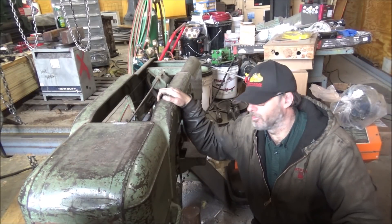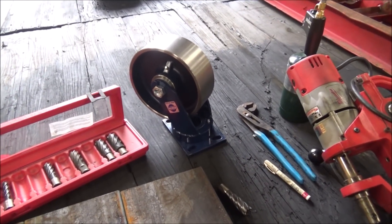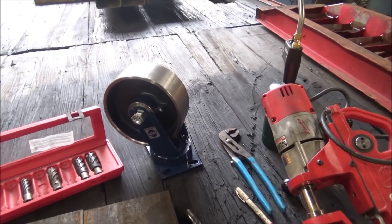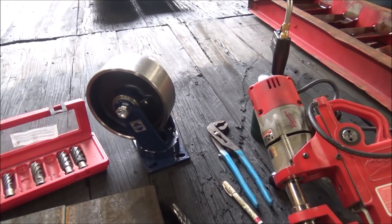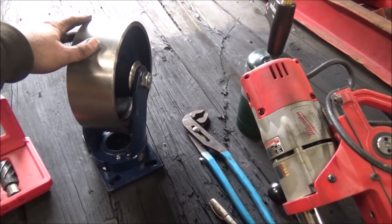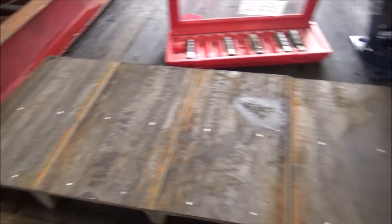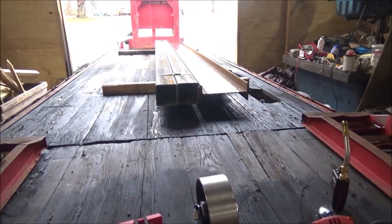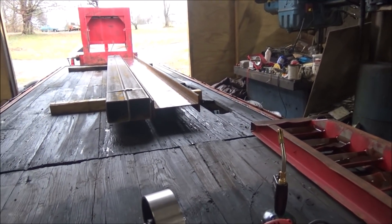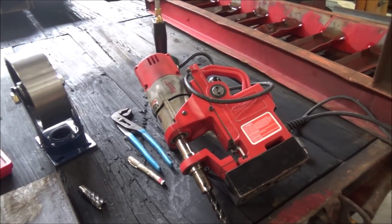Now they've got it all cut — it's drilling and welding time. Those gorgeous made-in-USA casters: big expense on this one, but we're going with a better caster than what was on the others because this is a lot heavier and bigger unit. RWM three-inch wide, eight-inch casters — should roll nice. My holes are marked out. I'm going to use the mag drill to punch these, and also drill that crane beam. I'm not going to wrestle it into the Carlton to drill the ends of the flanges — I'll just flip it up and drill it right there. Save a bunch of handling.